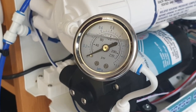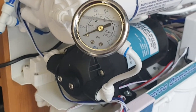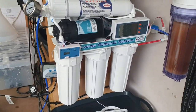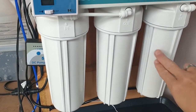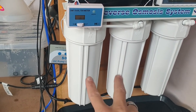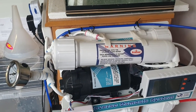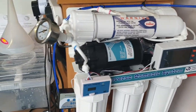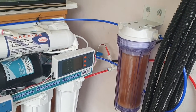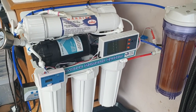The other excellent addition is the water PSI gauge. When the unit is on it goes up to around 90 to 100 PSI, and it can also tell you when your sediment filter is getting blocked because the pressure will reduce. So what I've got is the sediment filter first, then two carbon filters — originally it was sediment, carbon, then another sediment, so I've now switched to two carbons. That goes up into the two membranes at the top, both 75 gallons per day, then through the pump and into the external DI resin. I may even add a second DI resin above it to really fine-tune the output and hopefully make it last a little bit longer.